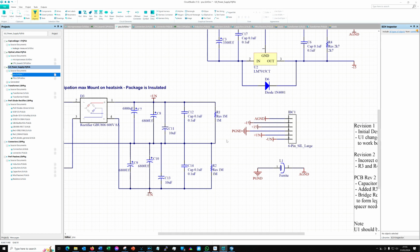This isn't high voltage at all. It needs to deliver, of course, about 4 amps. These are very low ESR capacitors. They're only about 25 milliohms. Sorry, yeah, that's not much, particularly with 2 of them in parallel. Now it is the case, of course, that with a capacitor working on DC, you don't really get the capacitance that you're looking at here effective. But it still seems an awful lot for what it's doing.